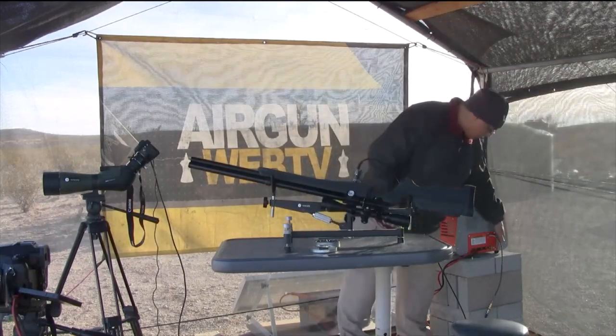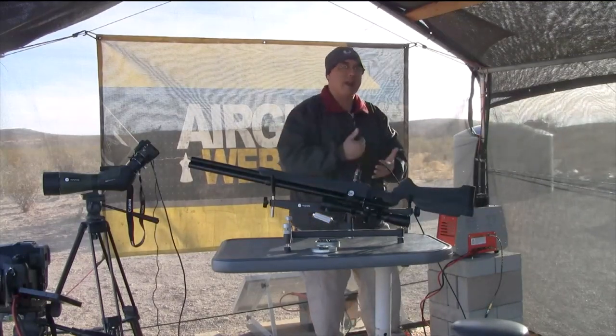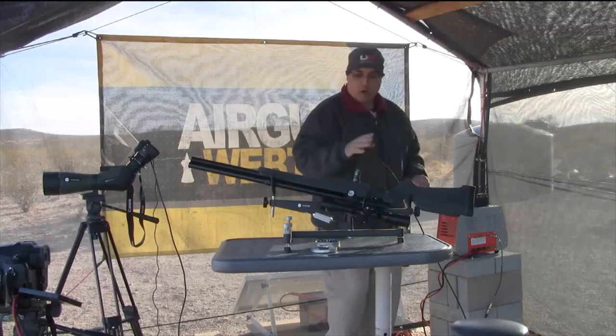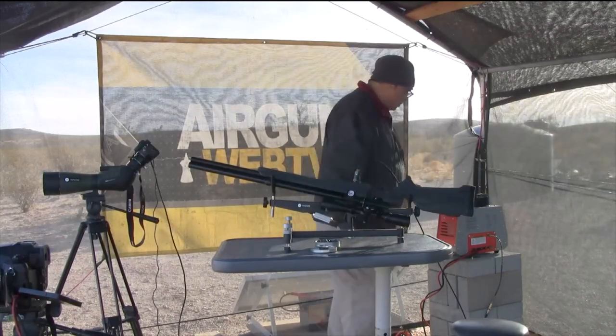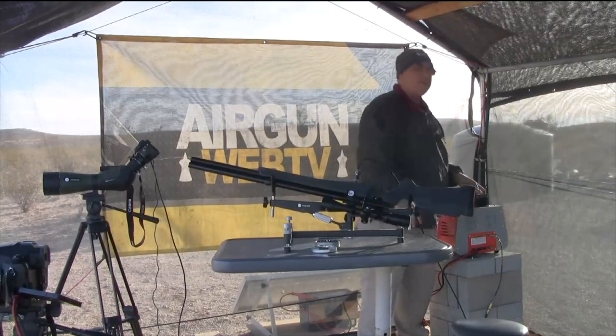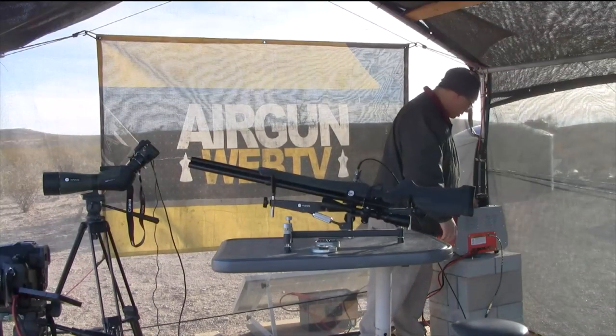All right, so I'm going to open up the bleeder. You always open the bleeder before you start. You never want to have this thing start on a load. You want it to build up to where it needs to be. So our gun's at 2,000. We're going to take it to 3,000 here. And I'm set. We're at 57 degrees on the compressor right now. So I'm going to hit go.